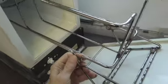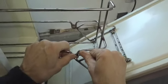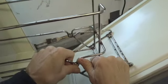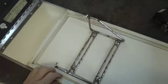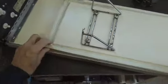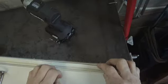All right, the first thing we're going to do is disconnect this door and push this in. And then this is spring loaded. Careful not to lose these bearings, which go in here like this. And we'll take the door off, and then after we get this thing apart, we'll look and see if these parts are still available. I don't know if this door seal is available, even though after 35 years it's in pretty good shape. I could probably soak it in some solution and clean it up a bit. So we'll do that. Let me get a screwdriver to take out this rack.